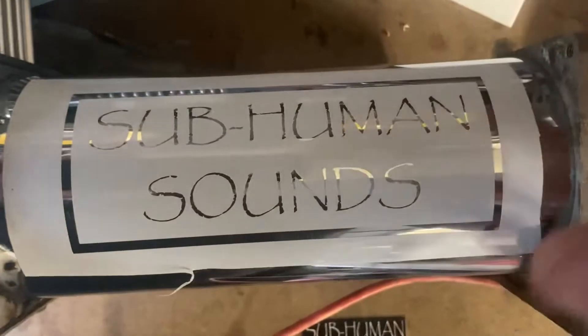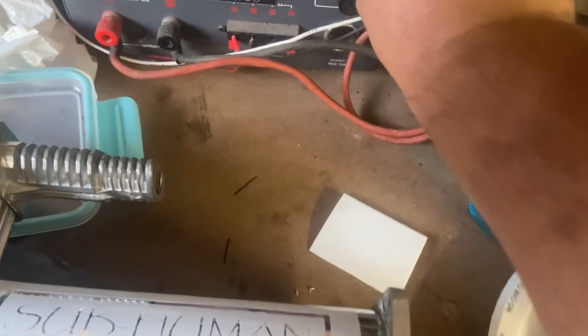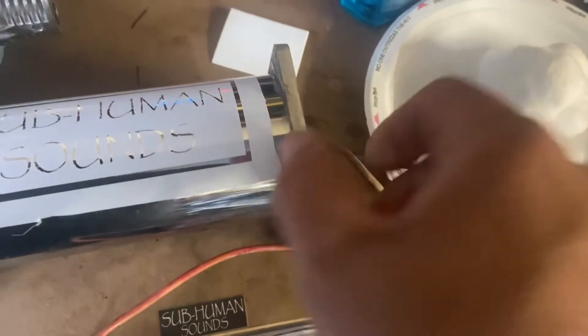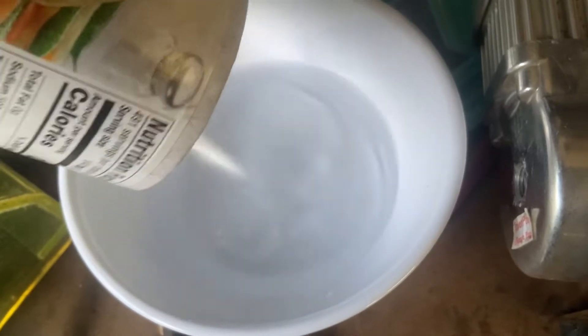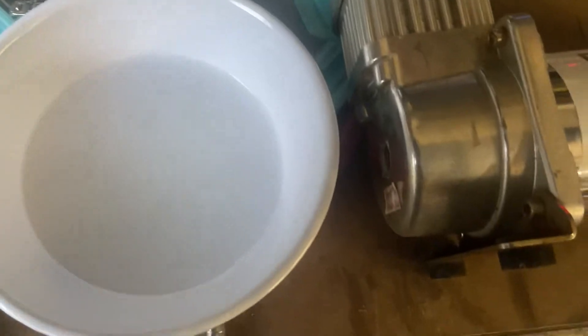The decal is placed on it. I've got a 12-volt power supply — you can use a battery. Honestly, the battery seems to work better than the power supply; this is just what I had available. The positive electrode will go to the frame of whatever it is you're trying to etch, since it's metal. Then a little tub of water — get a little bit of salt down in it.